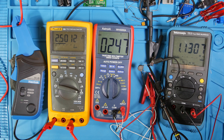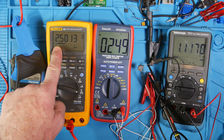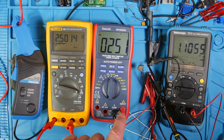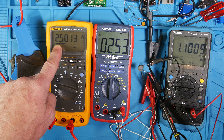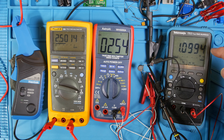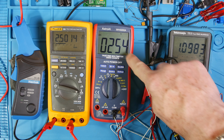We're at 246°F, 1.1 volts. The one thing about this 2.5 amps — if we had 115 to 120 volts AC power coming in with this thermistor, I can actually smell it getting warm. We had 2.5 amps coming through our thermistor off the 120V, that would be about 300 watts or 300 VA — that would be a lot of power. So that's probably a pretty good setting to see what a power supply around 200–300 VA would look like. This guy is starting to level off around 1 volt, we've got 2.5 amps going through it, and it's leveling off at 254°F.